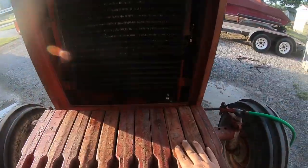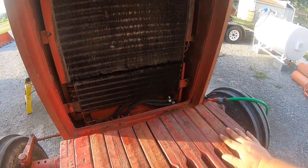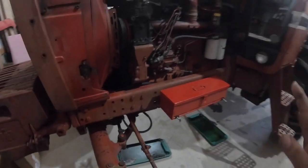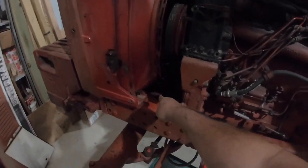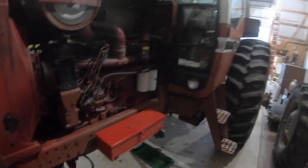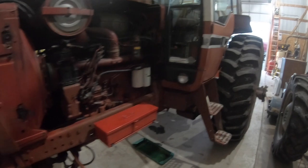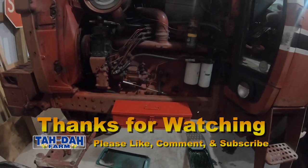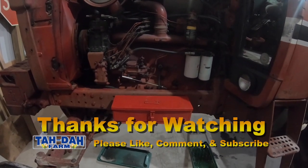We're going to let it run for a little bit. Everything right now looks pretty good. We got it back in the barn. All that's left is putting these covers on, but I want to clean the inside of them — we'll do that later. No leaks, everything looks good. I did spend a lot of time washing; there was boatloads of oil and crud down in there and we cleaned it while we had it apart. It does not run oil out like they said it does, so that's good. I didn't see any leaks down there but we'll keep an eye on it. Hope you liked the little project — changing the oil lines out on the transmission cooler. Thanks for watching.